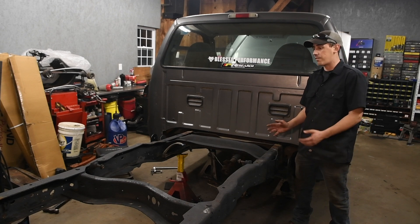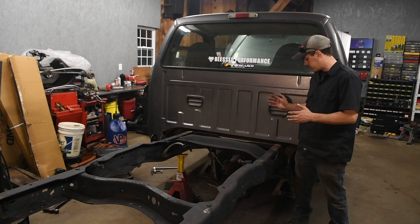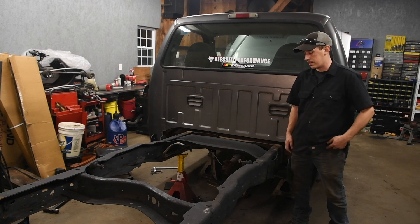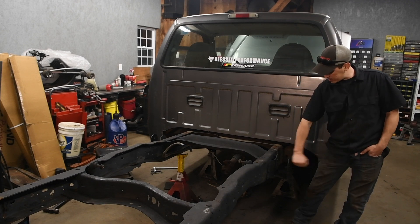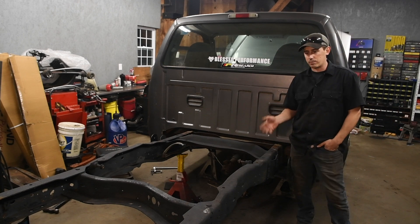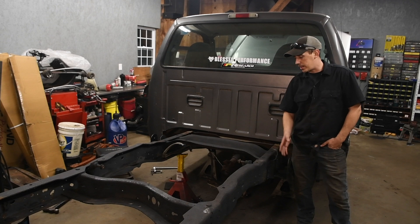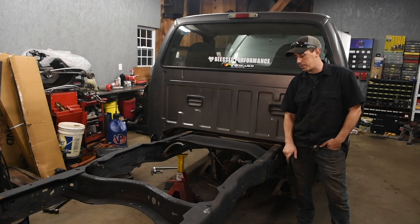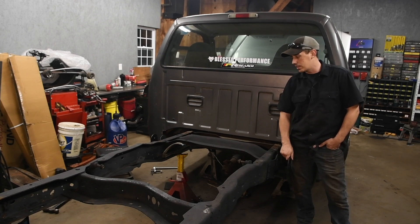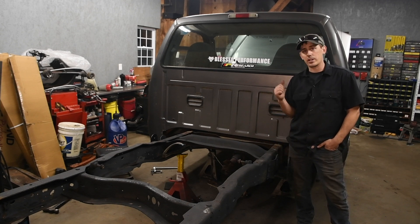This is a modification of the frame in front of the rear axle, so you just want to make sure this is as structurally sound as you possibly can. Aside from that, we're going to get rolling on the suspension. We already have these DJM brackets on. I want to get the rear done. I've got a nice fresh set of springs coming to put on it, and I've got an axle that's supposed to have a locker in it — we'll open up the cover and see if we got lucky on that one. We're going to put that axle in, try to get this thing sitting back on its wheels again, and then we'll start working on the front suspension.